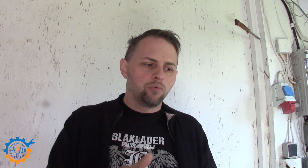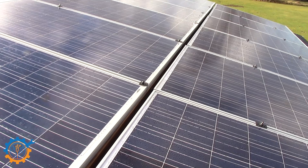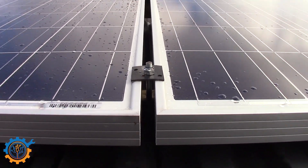Regarding snow in winter, that's a little bit of a bigger problem. But as I said, I have optimized this for summer use, so I don't care that much about snow on them. The panels at 21 degrees are steep enough to get the snow off, though it lands underneath the other set and can build up. The ones at 15 degrees shed snow as well once the sun comes out. I actually had to help it like two or three times this winter, but that's not a big issue.